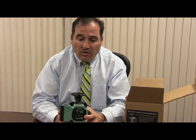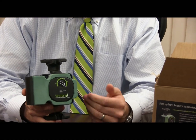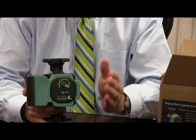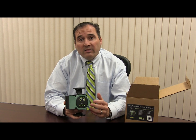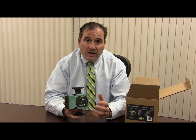The unit itself has three different modes of operation. To describe them: this pump can be used for zoning when you zone with circulators, which the majority of New England does. It also has a setting for constant pressure, which is specifically designed for American zone valve systems. And most importantly, it has a third setting called proportional differential, which is designed specifically for thermostatic radiator valves.